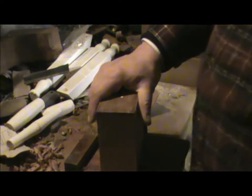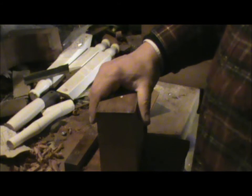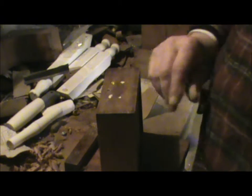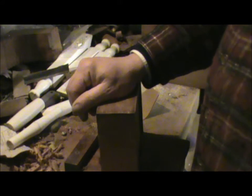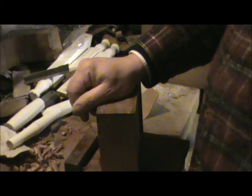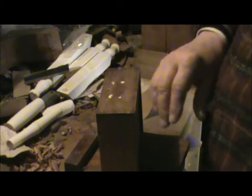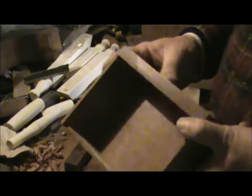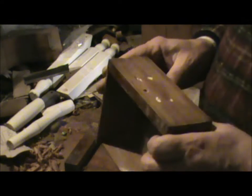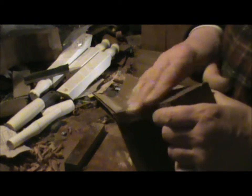The bit of the job I thought I'd have a little go at tonight is just surface prepping before paint. You might think, why don't I get a belt sander out or something a bit more vigorous than doing it all by hand? But these little drawer fronts, they are softwood and veneer, and all I want to do is remove the old varnish.